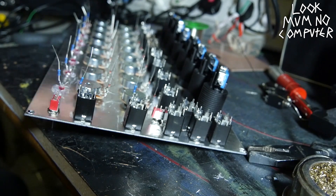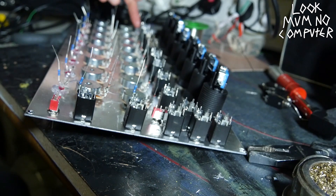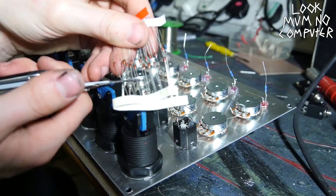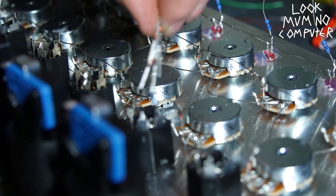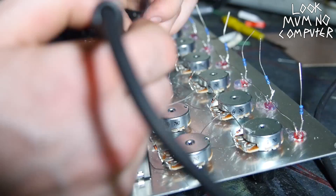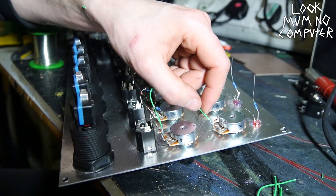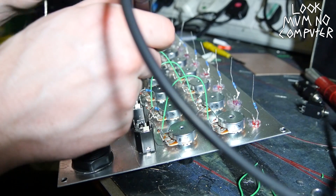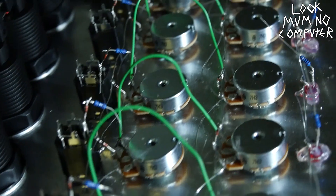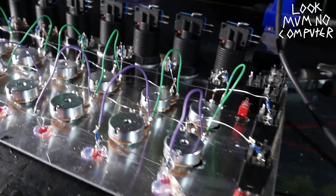There needs to be a wire that goes between all of the diodes and the output jack with the resistor on it. Get a bare wire and solder each line — don't solder them together, just solder each one. There's a line of bare wire that goes to every single center pin of the pot, past the diodes. Then connect all the rows together with more diodes — this time close to the black stripe, because electricity is flowing out of the jacks. Solder them down onto the jack outputs — these are the gate outs of each step — then put a 1k resistor on them. Connect the potentiometers together because each row connects to the same pin on the Arduino.